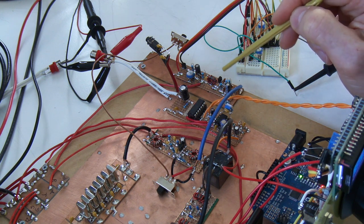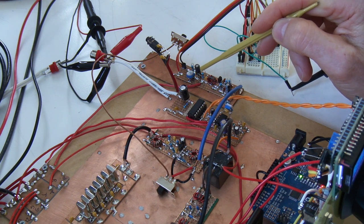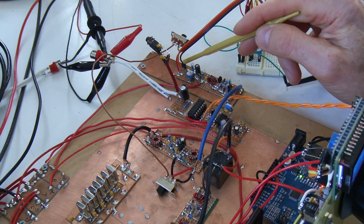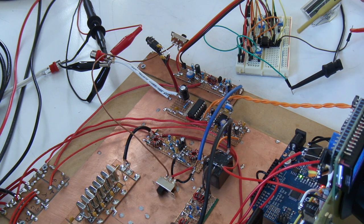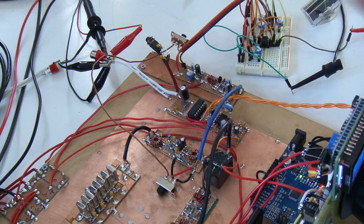The first part is just a simple RF amplifier, just amplifying up that IF signal. A detector there, just to detect the sideband energy. That's then being amplified, so it's now DC, so it's a DC amplifier. Then that's being fed into, at the moment, just breadboarded so I can play around, a 741 op amp, which is doing the negative slope to drive back over here, applying that variable voltage to the diode.